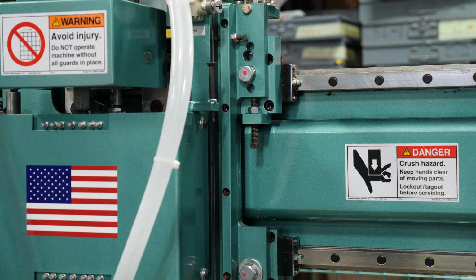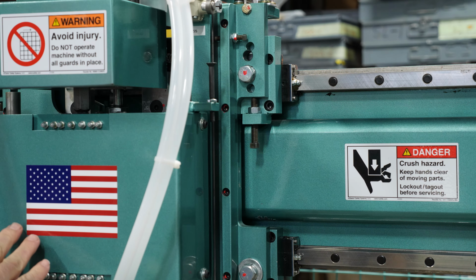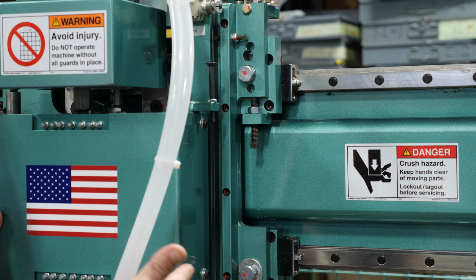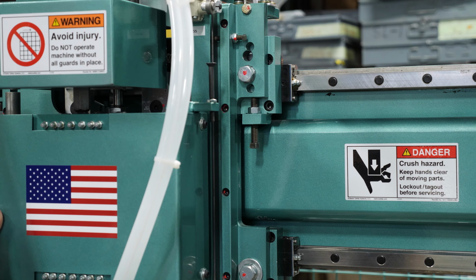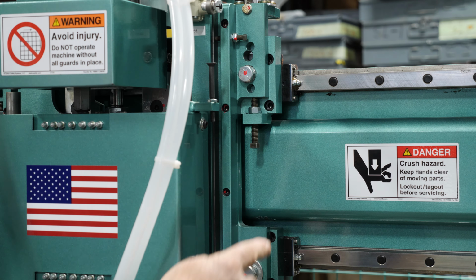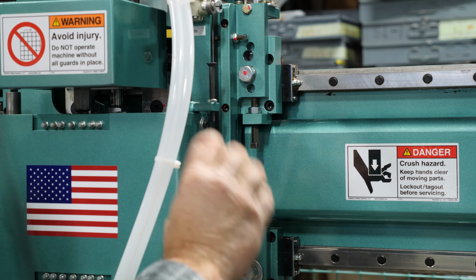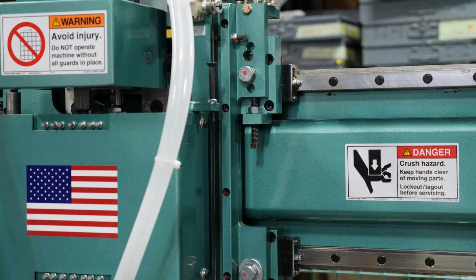The 6.8, this is head number 4 on the far right. It will not work under that when it's a 6.8 door. But when you're doing your smallest width door, the 8 3/4, we have to move this head out of the way because it's too low with this motor all the way up. So we have to pull this out of the way. This bolt here, and there's one on the other side, we have to raise this up. We loosen the bolts and raise it up out of your way so you can bring that motor underneath. We're going to show you how to do that right now.